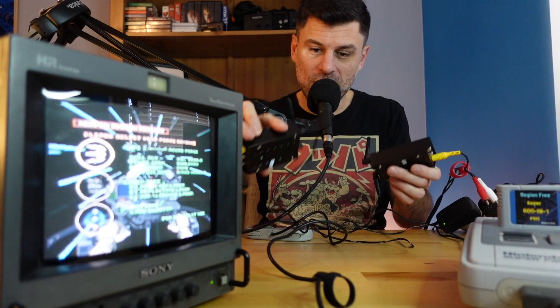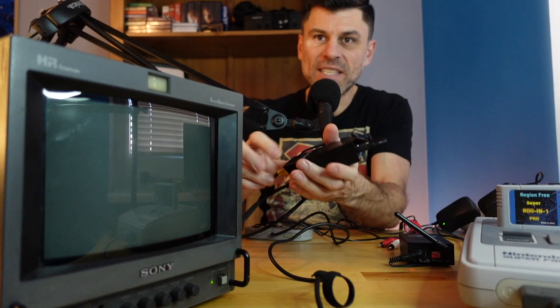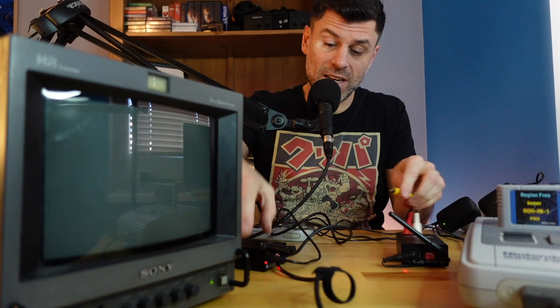It hasn't passed the video test. Who'd have thought for five bucks it's not working? One thing I'd quickly like to check is does composite work over the left or right audio? I've got it currently working over the transmitter and now I'm going to plug it in to use right audio instead. Transmitting now on right audio and we get nothing. So it seems like audio and video are encoded differently, as the manual in its Chinese English would kind of imply. And if we go back to the yellow port — a little bit of rolling, see that? This sort of sync — I don't know what this thing's doing, why is it rolling?